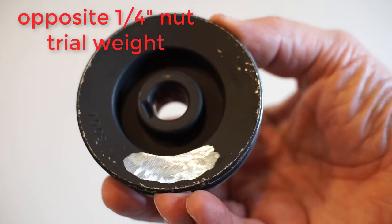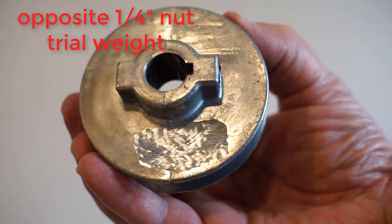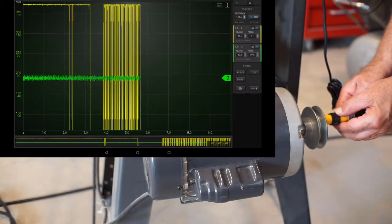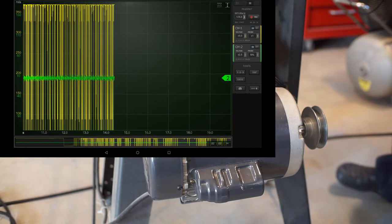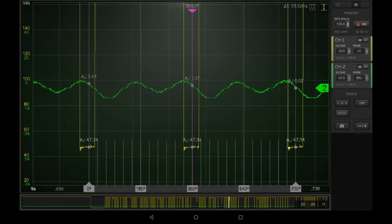I ground a little bit of material off the front face, and because there's a little more meat, I ground more off the back face. I'm going to retouch my paint on the front and do the final trims on the backside. Anchoring the 720-degree overlay again, if I measure in here we're within about 2 or 3 mils. I'm pretty happy with that — that was just one single rough grind. I could bring it down but it's running really, really smooth. I'm good with that.